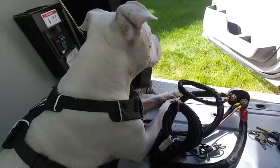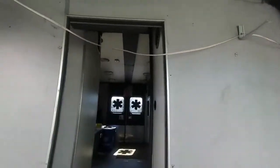All right, so I'm gonna get some cleaner. I'm gonna wipe down this wall to get it clean. I'm gonna get my vinyl wood-looking planks out here, my construction adhesive in the caulking gun, and my razor blade tool and get this slapped up here. It shouldn't take me very long at all. Okay.